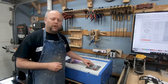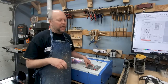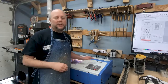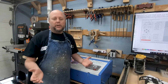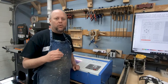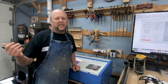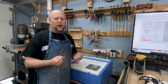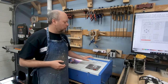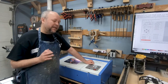What you're looking for is something with an analog reader like this. Not nearly as sexy but it has a lot better information, and it's measured in milliamps — that's how much power is going to the laser. This is especially important when you're going on online communities and sharing settings or troubleshooting, because they're going to want to know how many milliamps you're running. Honestly, 10% or 20% doesn't mean anything — there are no concrete numbers people can reference. So if you're in the market, look for the blue ones with the analog readout.